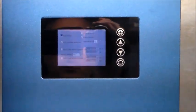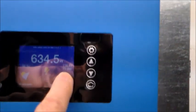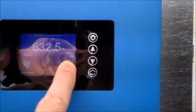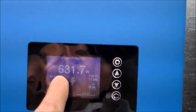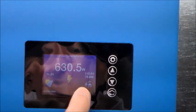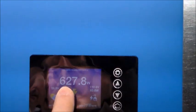The other thing I wanted to talk about is that initially when I set these devices up I had a problem with one of the readings. This reading here shows the amount of power being produced in watts. This other reading shows the amount of power being fed from the grid — right now I'm using 631 watts plus 75 watts in my home on this leg of my circuit panel, and I'm currently getting 81 watts from the grid, with the rest coming from solar.